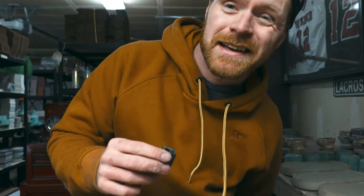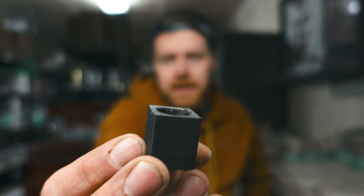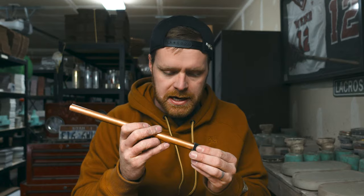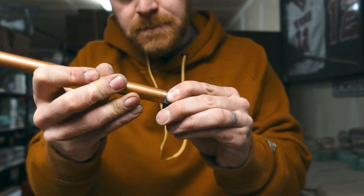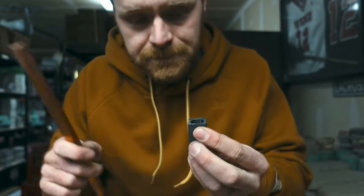All right. First one, first little cube. I just got my calipers and made sure that the diameter was roughly the same. Going to get this little guy. It doesn't fit, and that's why we do these test runs. I don't want to print a huge block and waste all the plastic, waste all the time. That diameter hole is not going to fit.